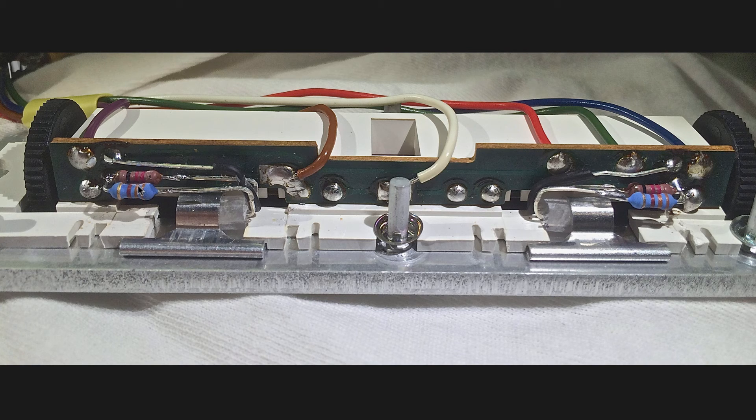This varies depending on the LED models, because the colors in these combination bulbs can widely vary in intensity per voltage applied. One needs to play a little with each product being considered. What I found by trial and error is that one should use a fairly bright LED — something with maybe 60 millicandela or more per LED.